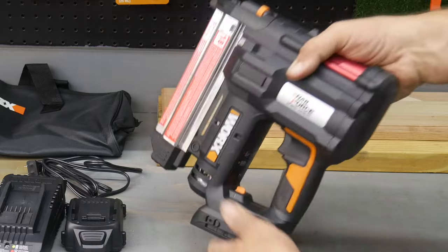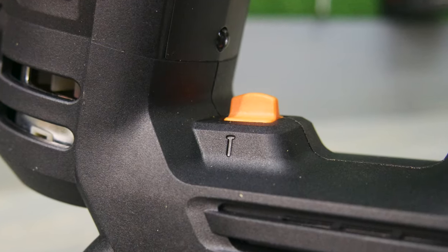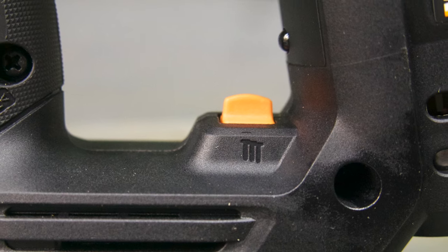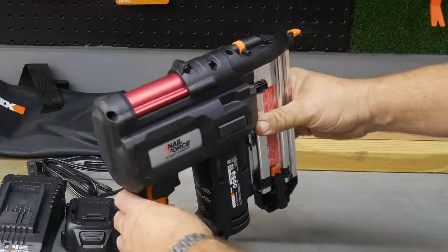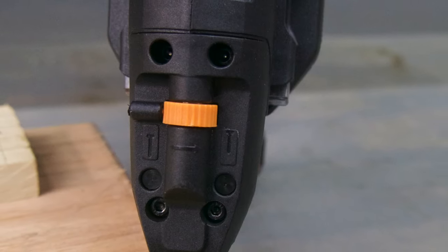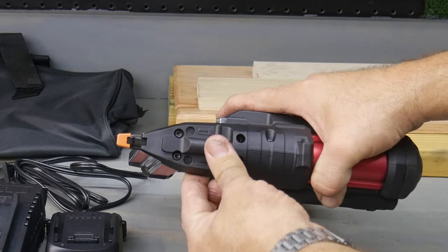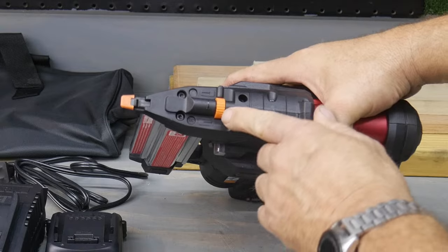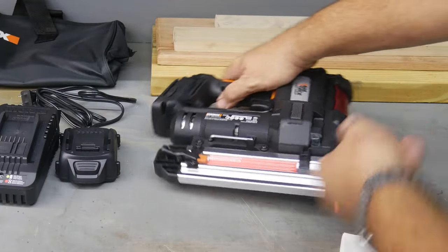One of the features we noticed right away is the rapid fire and single fire mode. You get a little switch down here in single fire — you can see the single nail symbol there — or you can flip that over and it puts you into rapid fire mode, with a symbol showing three nails in a row. That allows you to bump along and do rapid fire without having to release the trigger. Right up here on the front side, you can set your depth for the nails or staples. There are some detents, but it's pretty easy to turn — you still get a nice firm feel for those different detents, and you can easily rotate it depending on material type and fastener size.